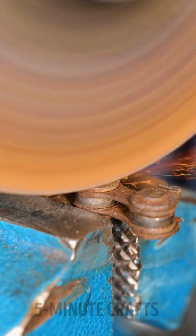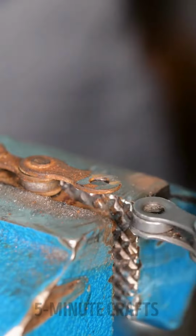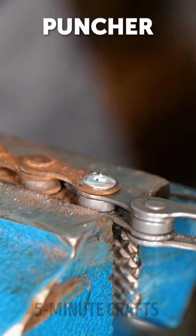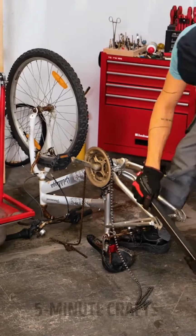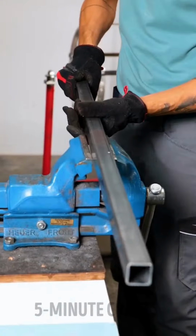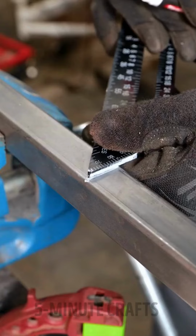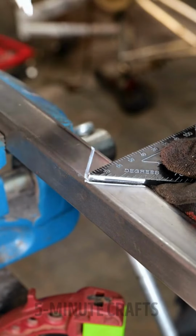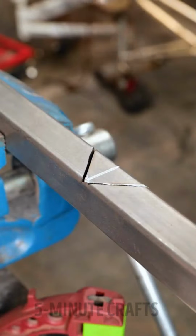On the other hand, he dismantled one of the bike wheels, removing the chain. This chain was then connected to another pre-prepared chain. With a few more metal pipes, he constructed a rectangular frame and attached it to the grill. The bike frame, now minus its front wheel, was secured to this structure. Finally, he meticulously aligned the long chain connecting the bike to the grill wheel. This ingenious setup would be the driving force behind the grill's rotation.